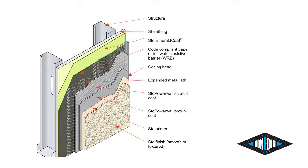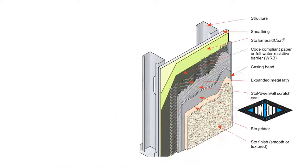So I get it. Now, you've described a couple of different systems, and I think you brought some samples. I did. Can you walk us through those two different systems? Sure. So we're going to start with a hard coat stucco, and as we look at the hard coat stucco, all the systems are going to start with a sheathing of some type. Typically for hard coat stucco, it's going to be a wood. We're going to add a weather barrier. Here it's going to be 2 layers of 15-pound felt paper. We're going to add in our metal lath, which is going to be mechanically attached. We're going to put a cementitious scratch coat on. In a lot of cases, manufacturers today have one coat, so it'll be a scratch and brown coat combo. The thing to note is they should be no thinner than 5/8 of an inch thick. And then our very top coat is going to be a finish coat, which today is pretty much an acrylic type finish that goes over the top, gives us a nice uniform color. So that's a hard coat stucco.